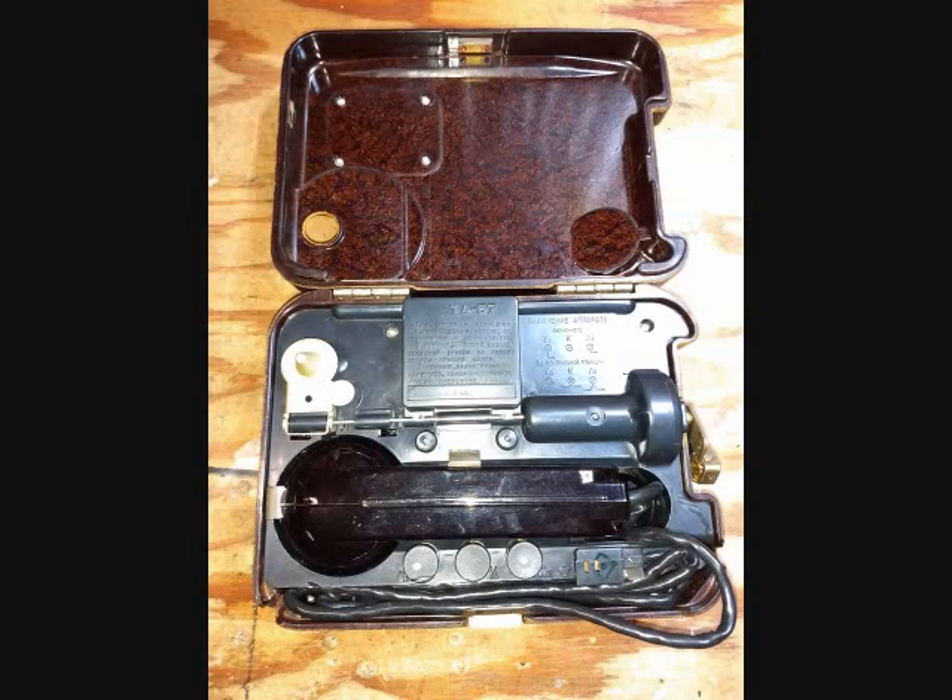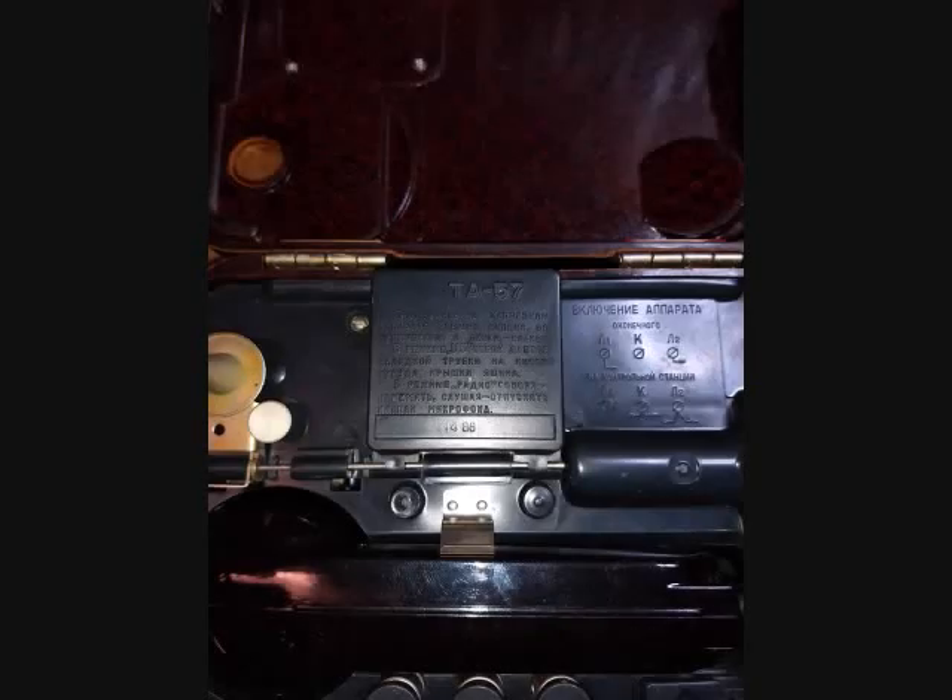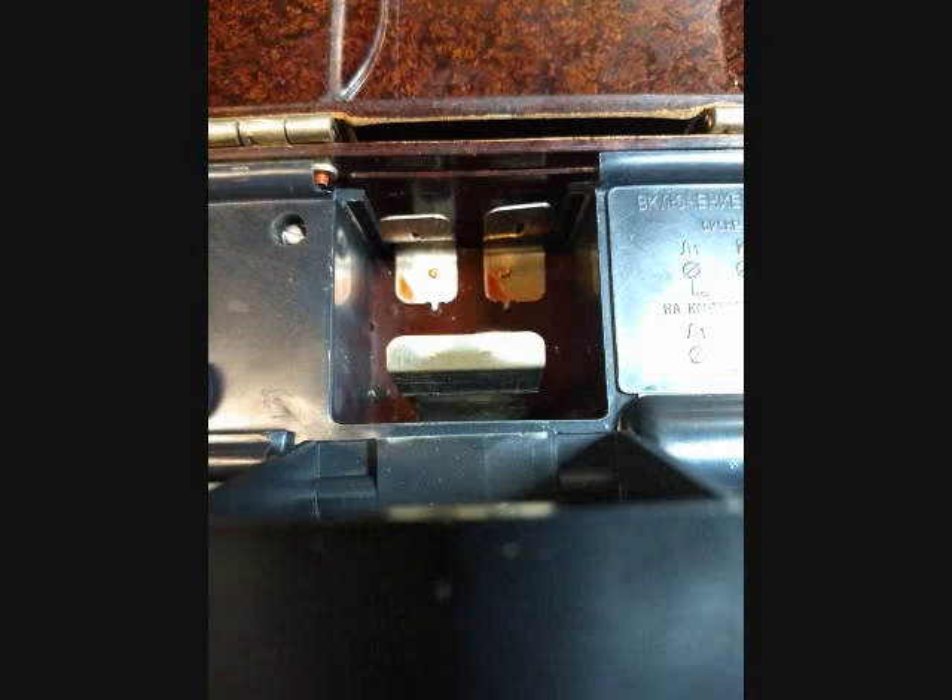We'll open up the TA-57 field phone — here we go, open up the cover and there's the battery compartment. It has the same issue as the P193 switchboard: it uses that square battery, but in this case the battery actually fits sideways inside, and a spring clip in the back holds the battery firmly against the forward contacts. The solution is similar — you can either take alligator clips and a 9-volt battery and clip onto each contact to make contact, or solder, though I've heard of people doing both.